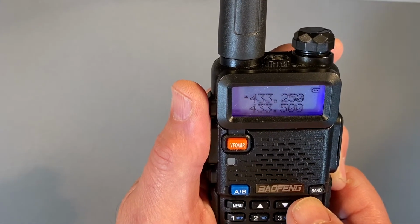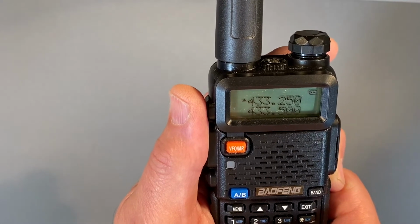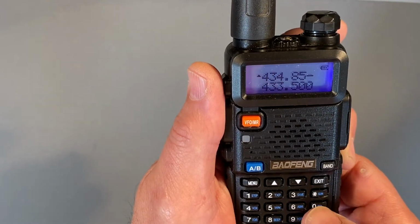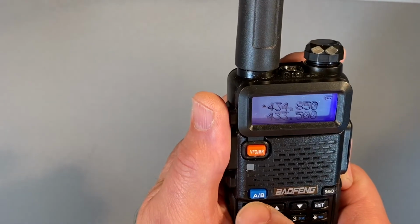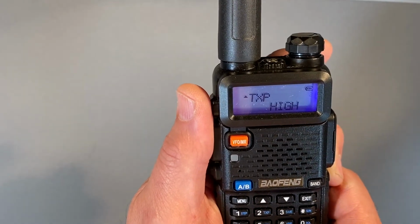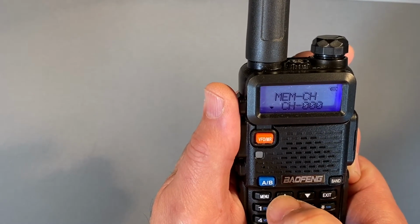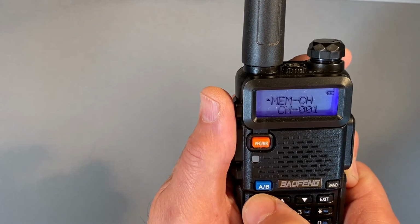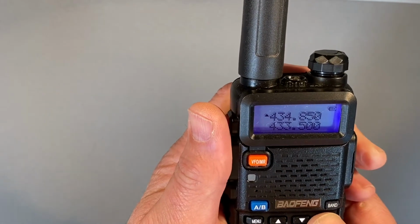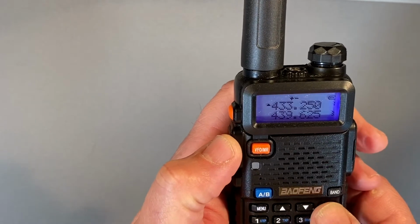Exit that, and then we want our transmitting frequency, which in our case is 434.850. Then we're going to put that in the memory channel, so it's menu 27 I should say. Press menu again, find our channel 1, press menu, transmitting memory. Exit, and we're done.